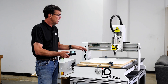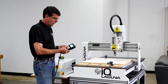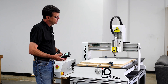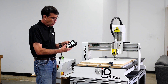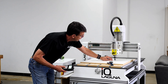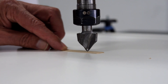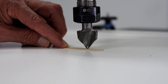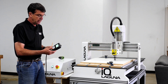Where I use this is when setting my Z zero, and I will demonstrate that. I'm going to go back into continuous jog speed and jog down my Z axis and get it fairly close. Now I'm going to push my mode button — now I'm in step jog — and I'm going to leave it in high speed and hit the Z minus button to move a half a millimeter at a time. I'll get real close, then go back to the low jog speed, put my feeler gauge in there, and move a tenth at a time until I get just a little bit of drag on my bit. Then I know I'm just about perfect and I can zero out my Z at that point.